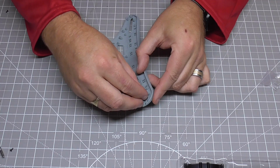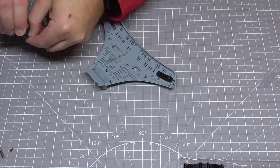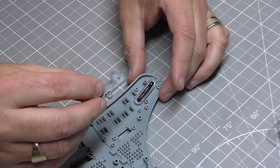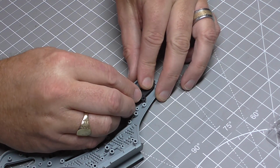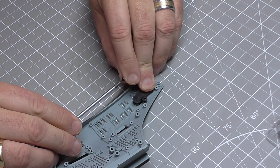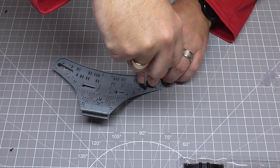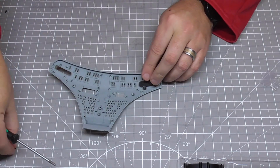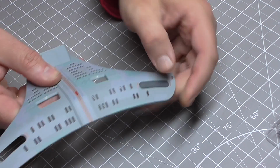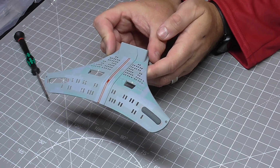And one there. And then on top of that, we have got a plate to put in, which is going to hold those springs into place. So it's going to go in this way. It is stamped with an L for left side. Put it over the top just like that. And then we're using AP screws, which I have already got here, to hold that in. So that's one. And that one's 2. So as you can see, that's in place, and it is able to be pushed, as you can see. Excellent. We're actually finished with this part now, so I can put that to one side.